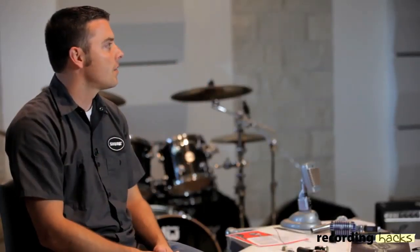The inherent things that are kind of wrong with a dynamic microphone are, it has a resonance frequency to that diaphragm, and it has a frequency response that isn't quite desirable. It's not linear by any means, and has big peaks and valleys to it. So we're going to want to fix the response a little bit. We're also going to want to create a directional microphone somehow. Make a unidirectional microphone instead of an omni one. So we'll talk about that.